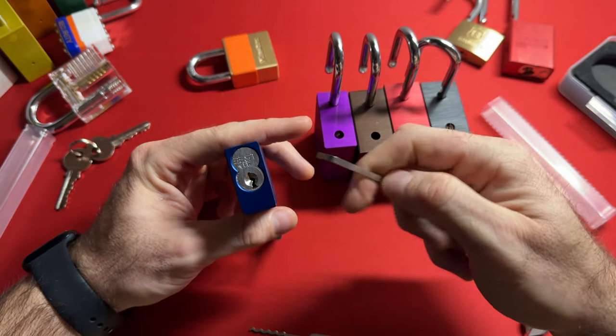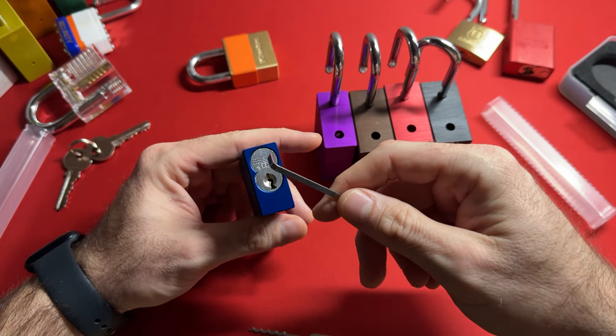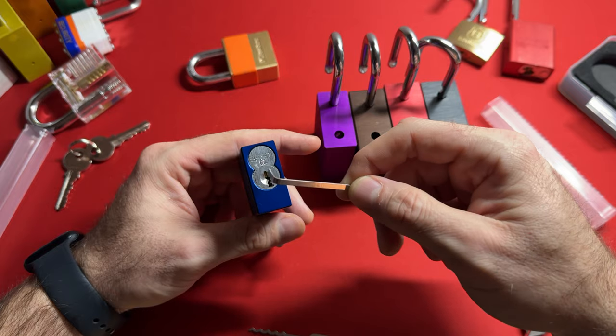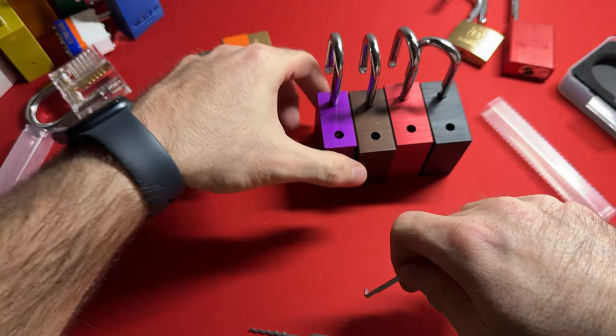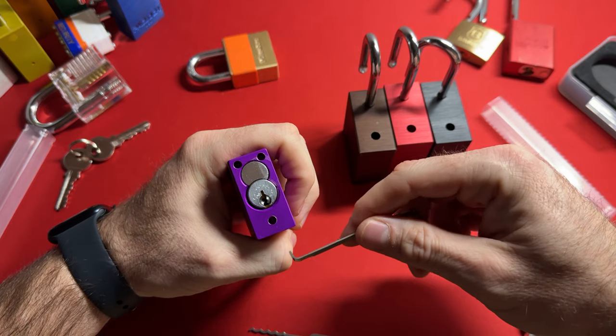So if you were to go to, I don't know, any commercial space in North America, it's probably going to have an interchangeable core like this, and it's going to be either Best or Falcon, or it could be Schlage or Medeco or something like that, but it's going to be this interchangeable core, and this keyway is super common. That's the bottom of keyway, and that's the top of keyway. I love that. Let's just keep cruising. So this is a Medeco biaxial.